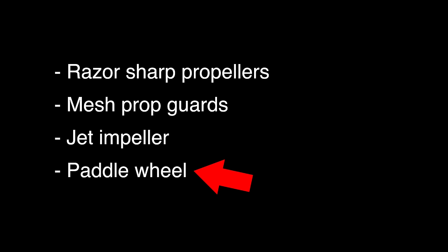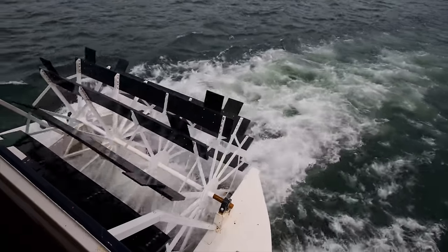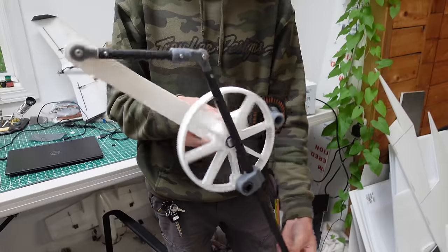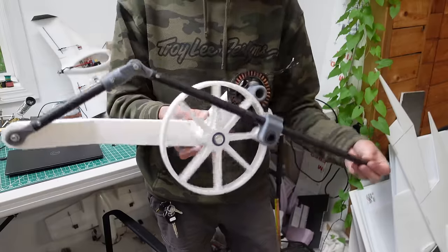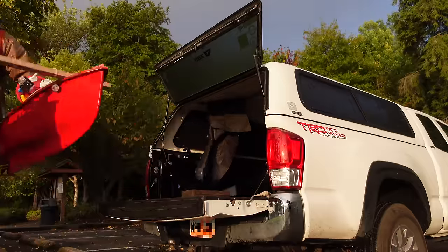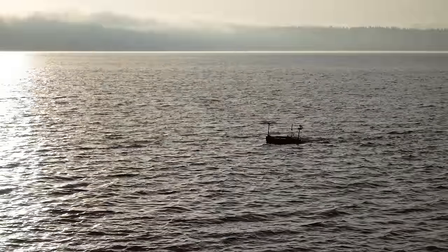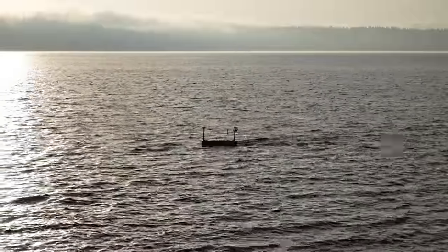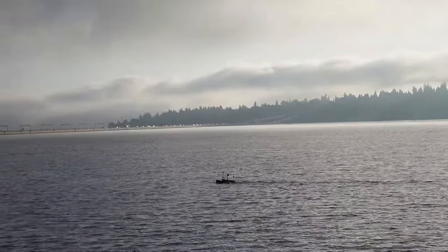Last up is the classic paddle wheel. Generally paddle wheels are less efficient than propellers, but I think that if you made one big enough, it could be pretty comparable. In this video, I am going to test what might be a more optimized but similar concept to the paddle wheel. So after deciding that I wanted to test alternative propulsion methods, I headed back to the lake for one last test drive with the old propellers to collect some efficiency data. We're going to be looking at watt hours per kilometer, and this data is collected by the ArduPilot rover flight controller on board.